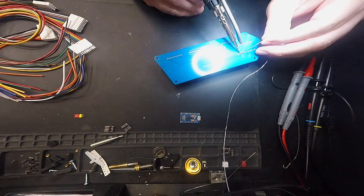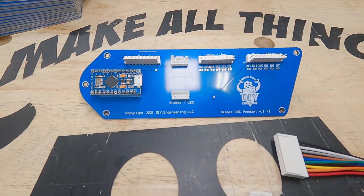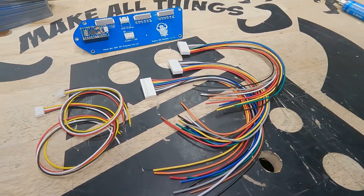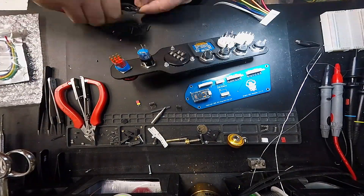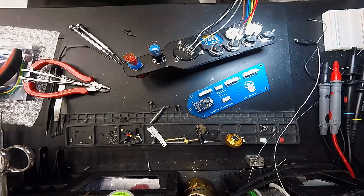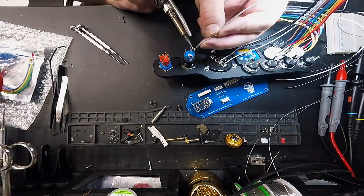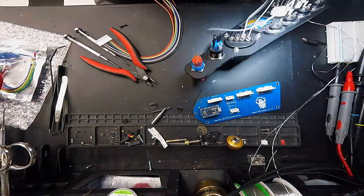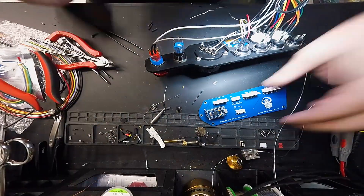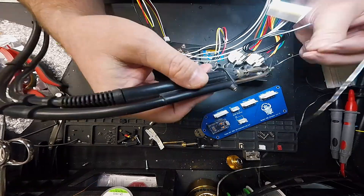Over at my electronics workbench I solder the resistors, header, and Pro Micro in place. With the board complete and ready to be mounted, I'll need to wire all the headers to the buttons, switches, and the display. Using the board as a reference I solder all wires to the button connectors, then use heat shrink tubing to insulate the connectors. The connections were separated into several headers: one for the momentary buttons, one for the axis rotary and jog wheel, another for the step rotary and e-stop, a 4-pin for the display, and another 4-pin for the enable button and LED.